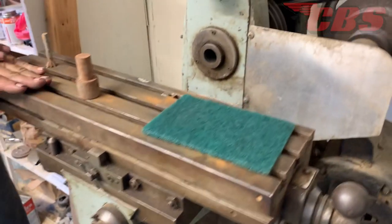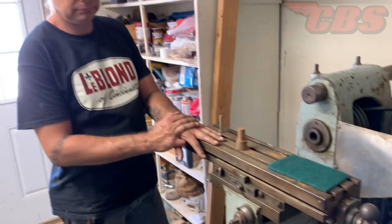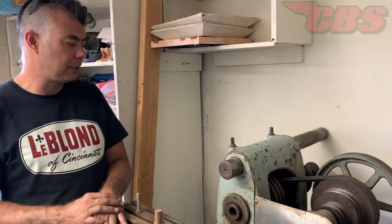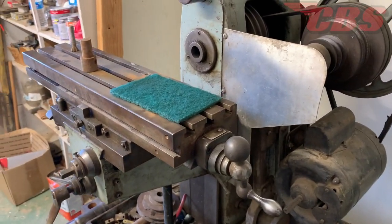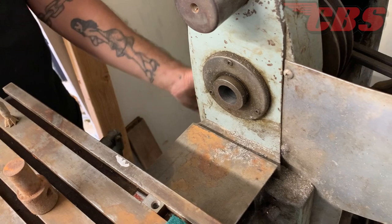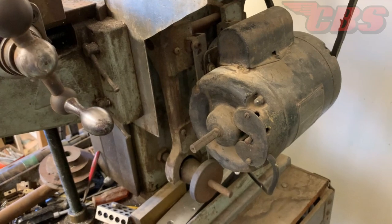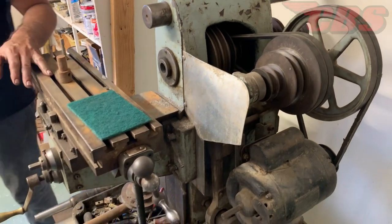Some cool features: it has a power feed linkage on one axis — there's a link piece being remade. This machine is single-phase, which is why it's in this building. The two-dimensional pantograph in here weighs at least 1,500 pounds — surprising for its size. You put a copy or pattern in, drop the stylus in the groove, follow it, and down where the work goes it reduces it by the amount set on the scale bars — you can make a part up to 40 times smaller than the pattern.